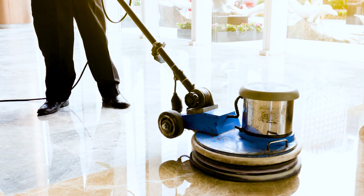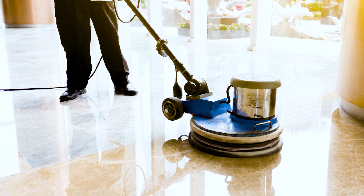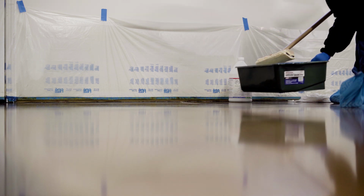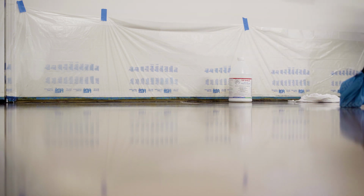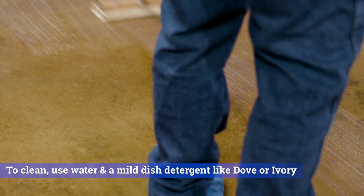You never need to use a buffing machine with mop-on waxes, although you can use a buffing machine if you like. Standing water for an extended period of time on wax can cause the wax to go cloudy or blue, but usually a good mop-on wax, once it is dried, will dry back down clear. Most mop-on waxes are UV resistant, but they will not hold up to chemicals such as gas, oil drips, paint thinners, or heavy cleaners like ammonia.